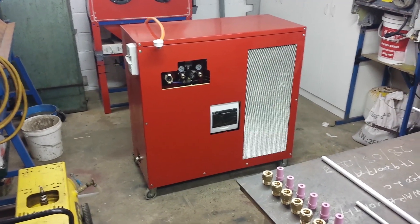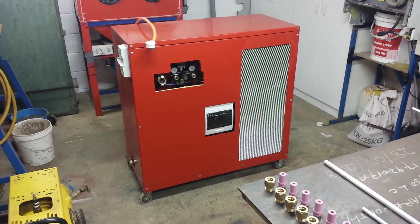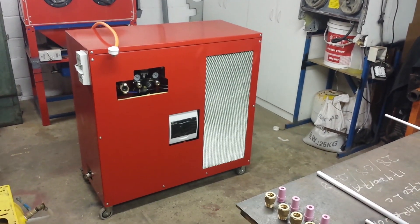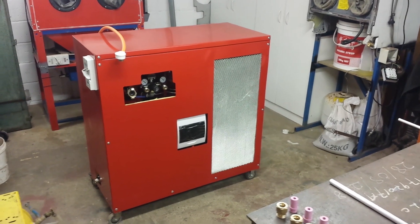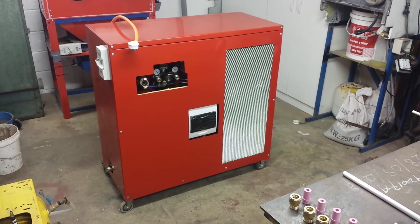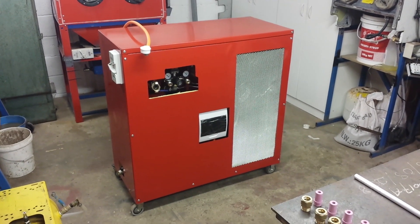It's got a max air delivery or pump displacement of around 40 CFM. It's probably closer to about 18 to 19 CFM at 90 PSI free air delivery. I needed that to get it tested properly, so I've been working on that. Just tested it today and it seems to be doing the job just the way I want it to. Maybe a little bit more information on that to come at a later date — I'll show a quick video at the end of this one of it running through a cycle.